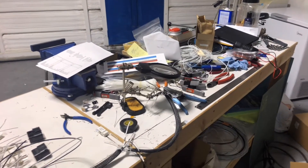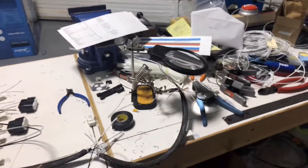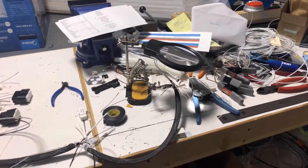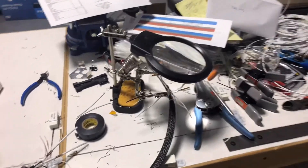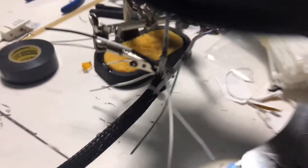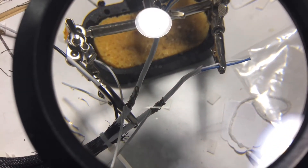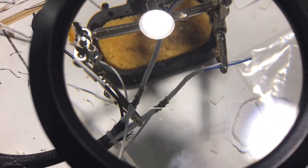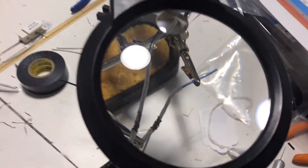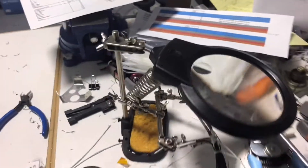The CAN bus is how the Garmin G3X system communicates with all the components. It requires shielded cabling — a special type of cable. I've got these all prepped with the shielding exposed. This one's getting ready for the soldering job so I can put the shield drain on that's going to attach to the connecting part that plugs into the back of the instrument itself.